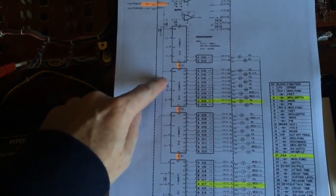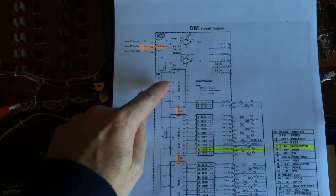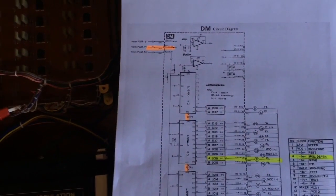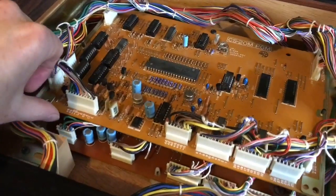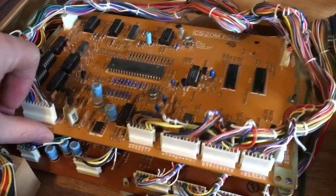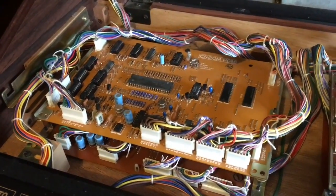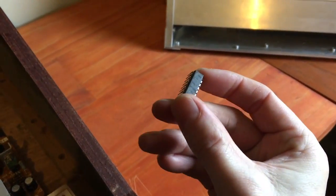So we've got these 3 working, and this one at the end is faulty. So I will need to buy another one of them, and they are super rare, almost impossible to find now, but I think I found one. So once that comes in, I'm going to put it in the circuit. Okay, I got the YM617 chip in, ironically from Japan. Probably came from another CS20 or CS40, because they're the only 2 synths that used that chip. Got the old one over here with black texture written on it saying dead.